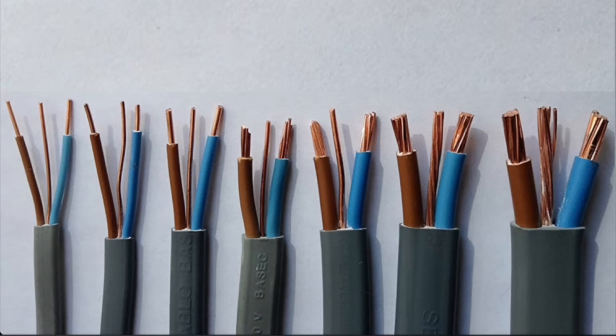In the workshop, we'll be referring to these as one millimetre squared PVC PVC twin and CPC cables — twin being the two live conductors and the CPC. So that's nice and clear. It comes a little bit different, however, when we think about the CPC on its own.